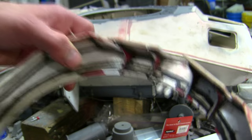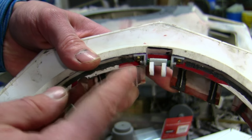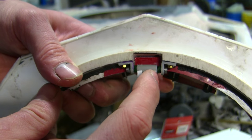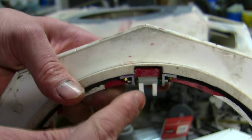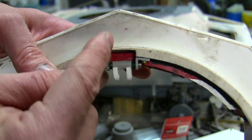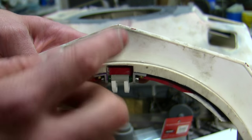On the front portion of the turret it's a little bit different. The front portion utilizes a yoke that is hard bolted directly to the turret ring. The yoke is actually centered, and keeping it compressed in the center are two coil springs. This detailing is found on the actual 222 vehicle. The purpose of the coil springs is that it always keeps the turret lined center and true to the gun carriage, and allows for a little bit of leeway in case any obstacles or obstructions are hit by the turret.